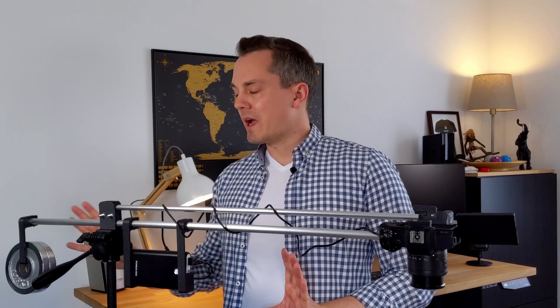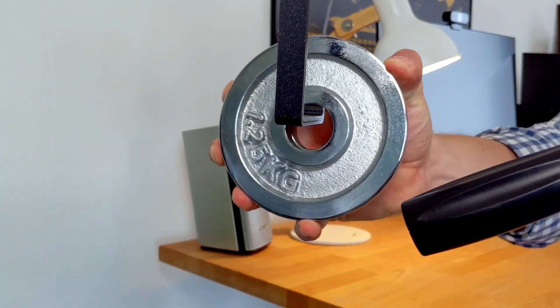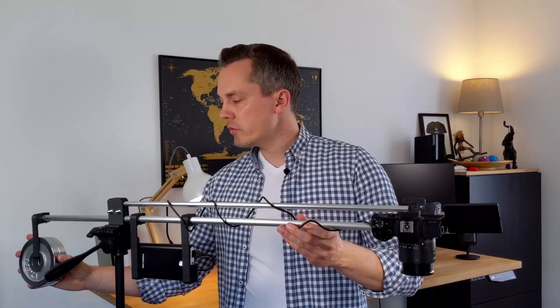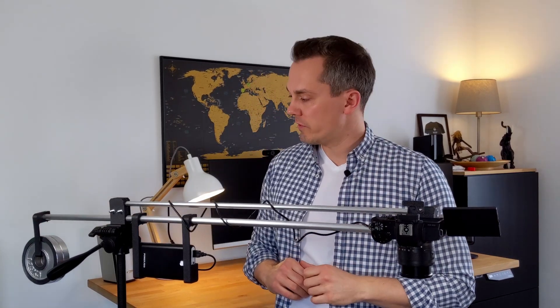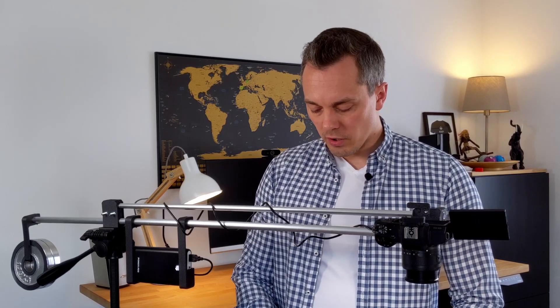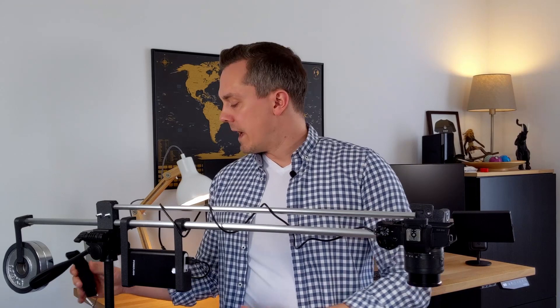Lastly, and very important, as with any jig you need a proper counterbalance weight. With a long arm like this, the pressure of the camera and the RGB light on one side needs to be balanced out. I've designed a weight plate holder which in my case holds two and a half kilos. This can be slid easily back and forth on the aluminium rod depending on the weight it needs to balance out. As a tip for deciding how much weight to put on one side, I recommend using a luggage scale attached to the furthest point of the rod or directly to the plate holder. Loosen the central screw of your camera stand, and whatever force the scale reads is the amount of weight you need to attach to the plate holder.